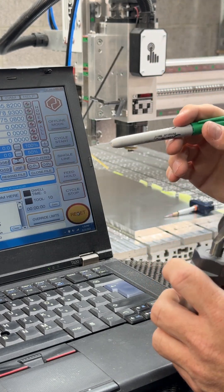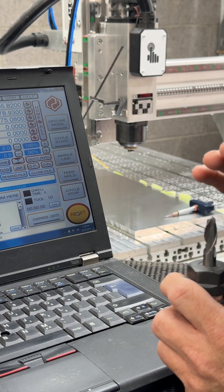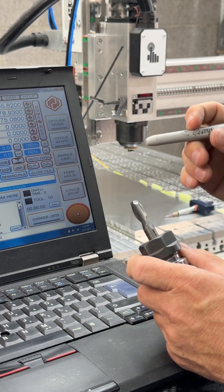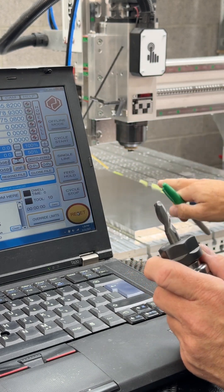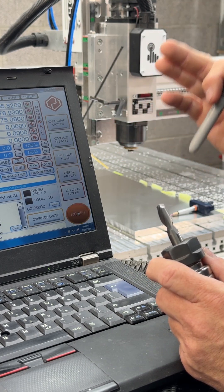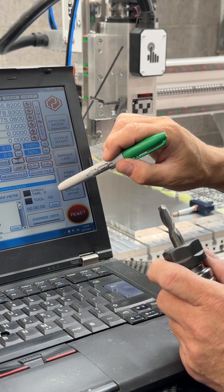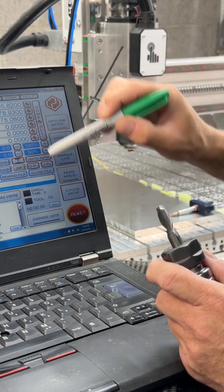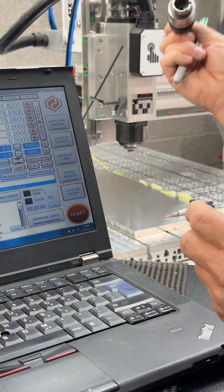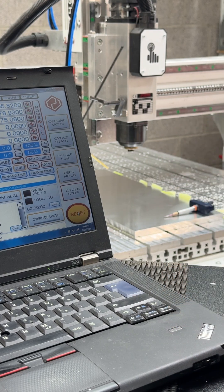Just as a reference, you can use any tool to do your job offset — even a chamfer end mill if you want. My personal rule is to always use the biggest tool I have. Anything else will work, but the key is: whatever tool you choose, say a six millimeter drill, that specific tool has to be active in your job list, and you slot that tool into your spindle to do your work offset.